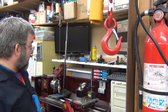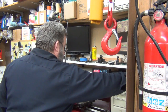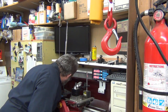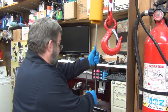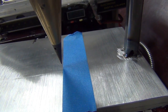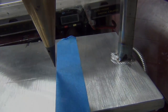I have that marking now. I'm going to move it to the end here, pull this forward a little bit. Hopefully that angle's pretty good - it's a 32nd of an inch off. I looked at it again and that thing was right over the edge of the tape, I was real pleased with where it was. So what I'm going to do is add some shim stock here and see if we can get it even closer.